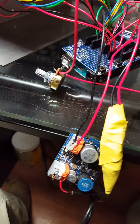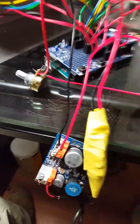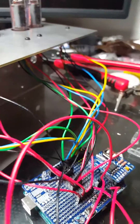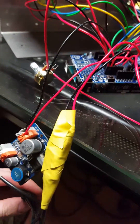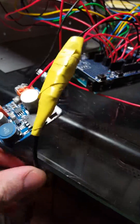Whenever you want to put your on/off switch on this thing, you can run it in two different ways. You can run it so that when you turn the switch on and off, it cuts the entire Arduino off as well as the tubes. Or you can run it the way I do it, where I wire the switch between the step-up chip and the tubes. That way your tubes turn off but the Arduino keeps running, and that saves the battery life on your DS1307.